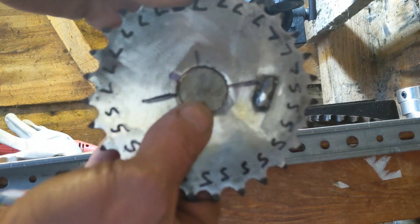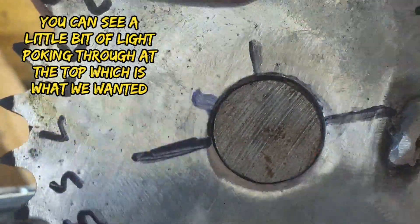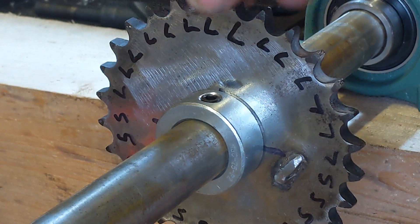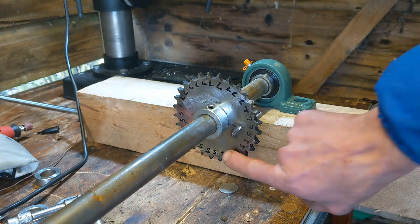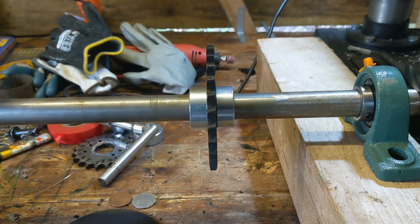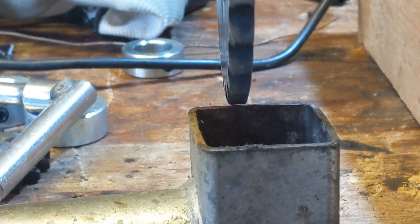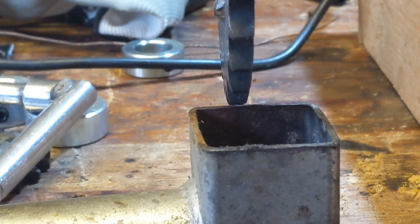There's a little bit around the top — that's what we want. There's a little bit of up and down movement so I'm going to try and sandwich those on the shaft and see what's going on. I've placed the cog in between two collars and pushed this side down so that any slack is now on the S side. I'm going to put the camera so we can film properly and then we'll spin it around to see if we've still got that up and down. When we spin it, it's looking pretty straight — there's only a tiny little gap and it seems to remain identical. I'd pretty much say we're on to a winner with that.